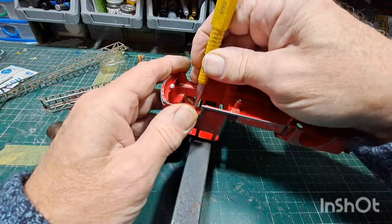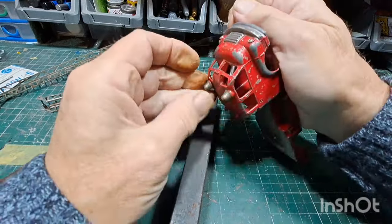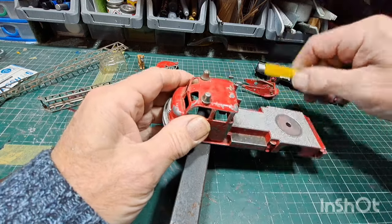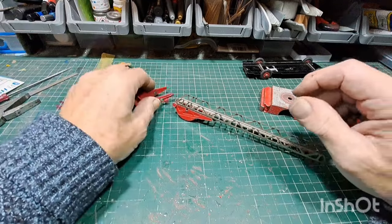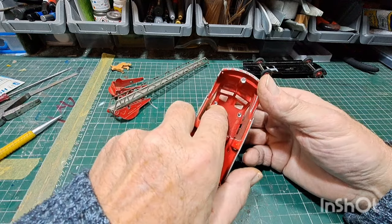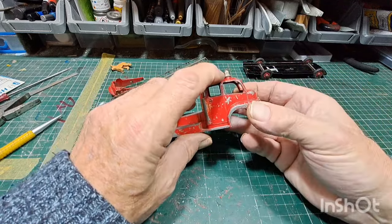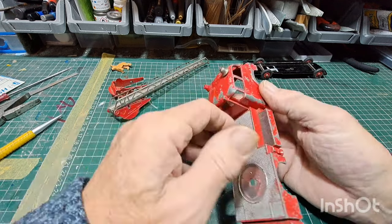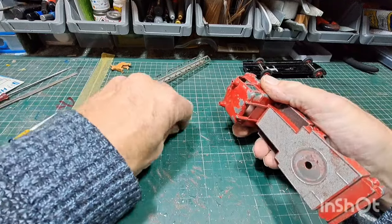Should be able to do that with this — gently. Get these bells out as well. Okay, it's always about that — we had to do a bit of jiggery-pokery and a lot of finessing. Right, we've got one bell off. What you basically do — I drill through there like you would do if you're getting a rivet out; it's a little tiny pin. I've found if you start banging it, what can happen is you can bang it too hard and you can break that casting around the roof area. So once you've done that, you get your pliers in and just pull the pin. And run — that's your bell off.